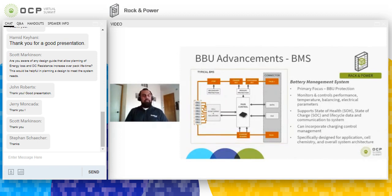Every BBU will have a BMS — a battery management system. It will monitor voltage, current, and temperature of the cells to ensure they're within normal limits, and if they exceed those limits it will shut down the battery. It will also ensure cells are properly balanced, performing cell balancing to ensure all cell strings have the same voltage. The BMS will provide state-of-charge readings communicated over a bus such as I2C, SM bus, or CAN bus. There will also be redundant protection features such as secondary over-voltage protection and current fuses.